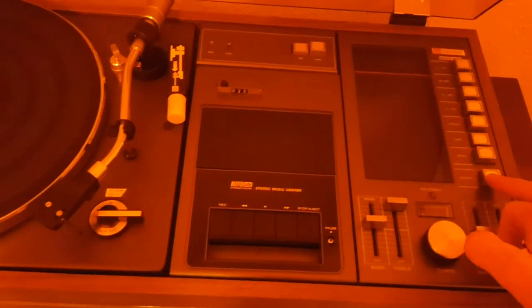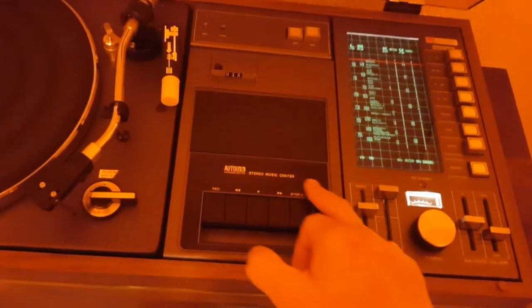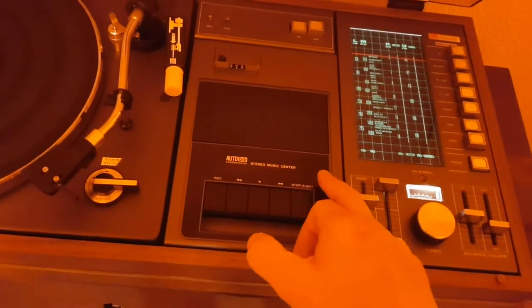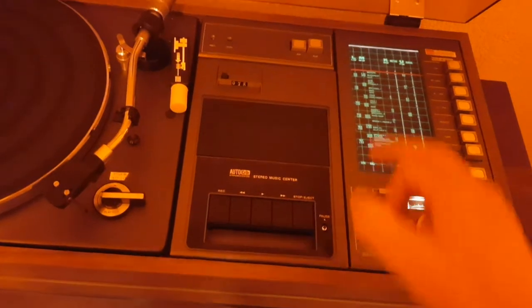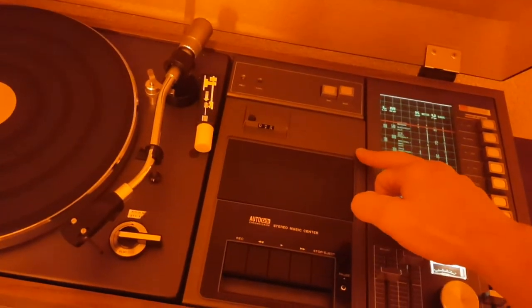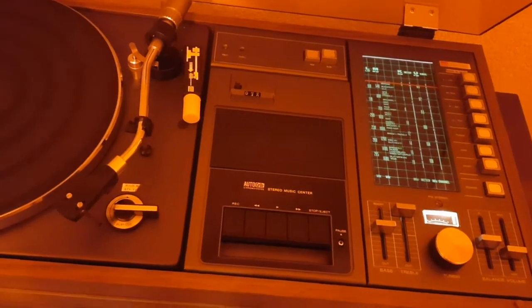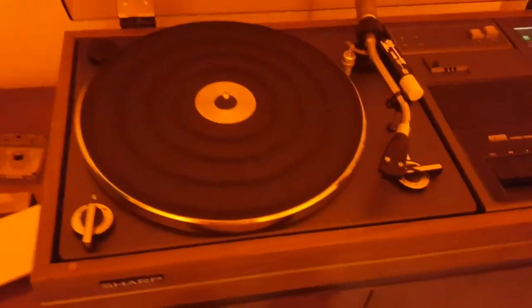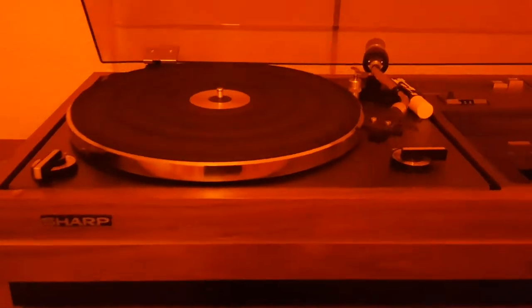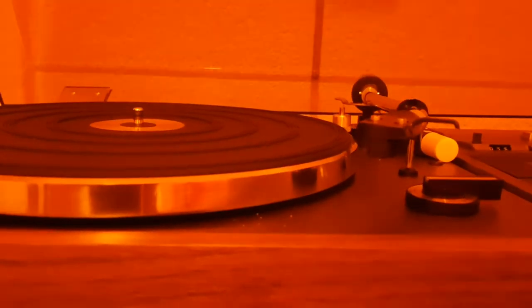The dial lights needed changing, so it's had new dial lamps, obviously new belts, and the usual Sharp capstan sleeve gone to goo, so that's been done. Changed the crappy self-regulating motor to a more modern motor, so it's had a new motor in there. Record deck serviced. New stylus rather. It's a ceramic stylus. Tracks at 6 grams, but it sounds really good.